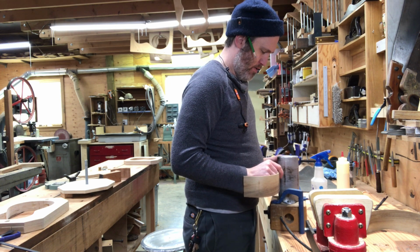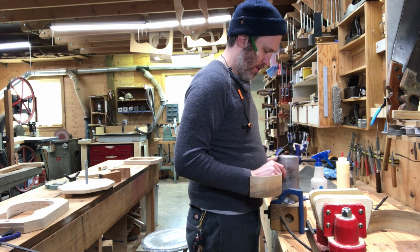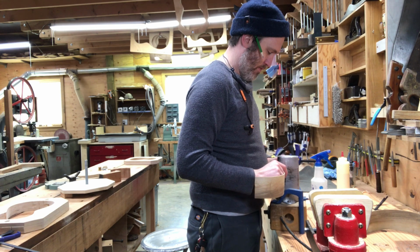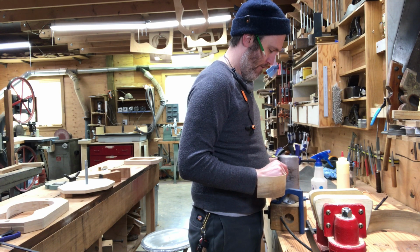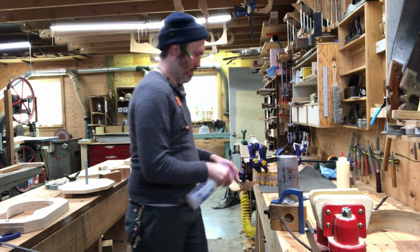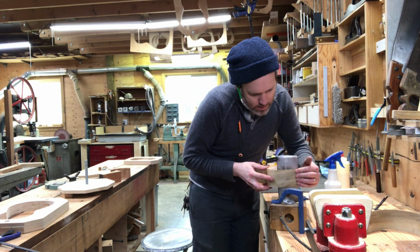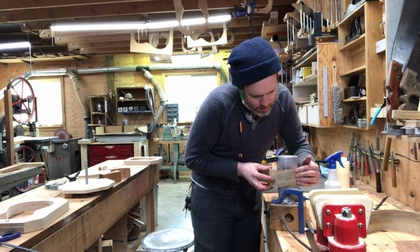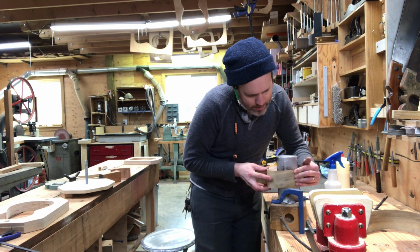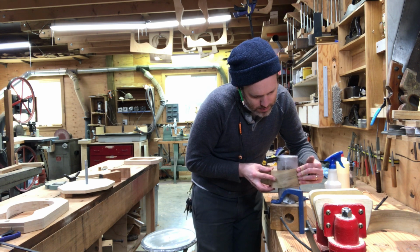Technique for the iron, it's really all about feel, and you only learn how to do it by breaking wood, unfortunately. So you can kind of feel when it really releases and it's done the bend. And let me just touch this one real quick. Sometimes certain bends respond better to motion on the iron. Some you can just hold still.